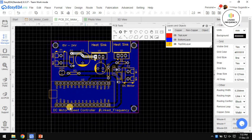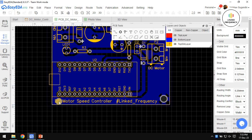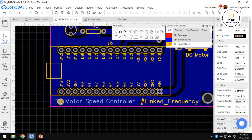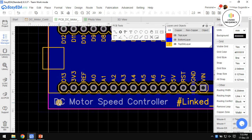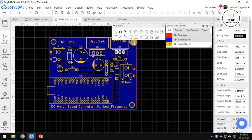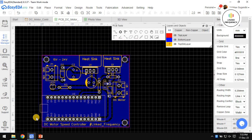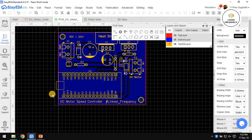And you can notice we have not given one more hole here. Why? Because our Arduino Nano needs to be placed here. As per this particular design, I felt this is the right place for the Arduino Nano, and because of that there is no possibility to give a mounting hole for that. In such situations, if you are giving 3 mounting holes for the 3 corners, you can ignore one corner if it does not have a lot of vibration or mechanical imbalance.